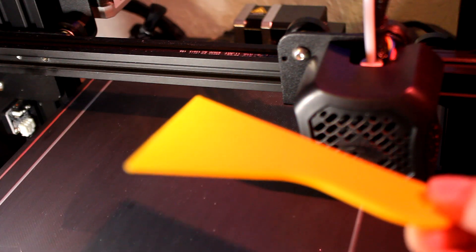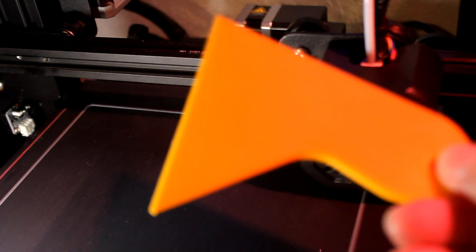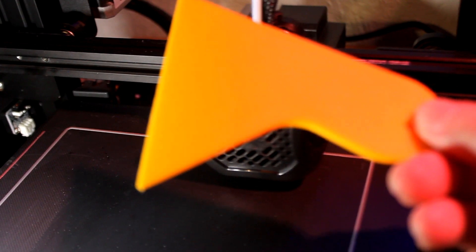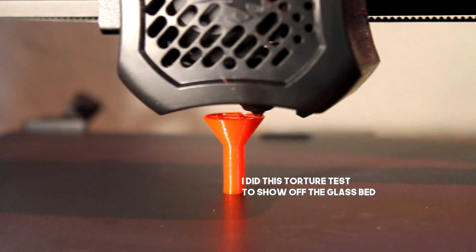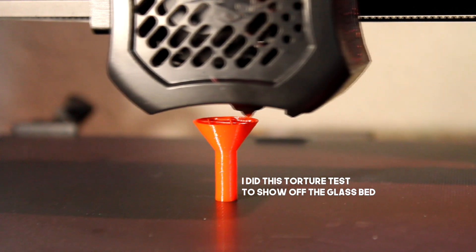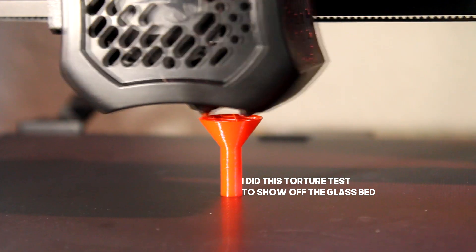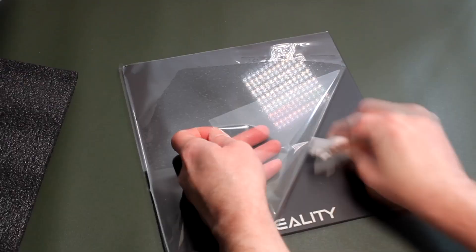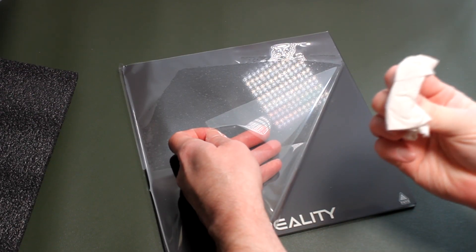Don't use force to remove the part or you might take off some of the coating — I've seen it more than once. If you're struggling to get the part off at room temperature, you can freeze or refrigerate the bed and that will usually do the job. Now in the future if the bed gets dirty, especially greasy — usually from fingerprints, which is why I advise not touching the bed if you can help it — I use a plastic tool as much as possible. If the bed gets grease on it, it can seriously affect adhesion again, and the process is the same: just clean it and give it a decent amount of scrubbing. You can preheat the bed to make the finger grease lift off without soap. And if you're wondering what the coating on the bed is, I have no idea. Apparently you can't even see it, which I think is why it trips a lot of people up.